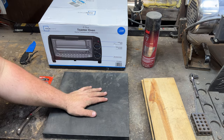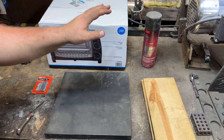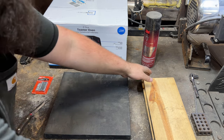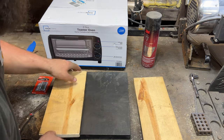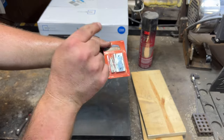Here's all of the things that you're going to need to make this Kydex press. The most expensive thing on this table is the Kydex foam itself, and that's only like 30 bucks over at Maritime Knife Supply. Steal the deal. You're going to need two pieces of wood that are roughly the width of your foam, some Super 77 adhesive spray, and some hinges.